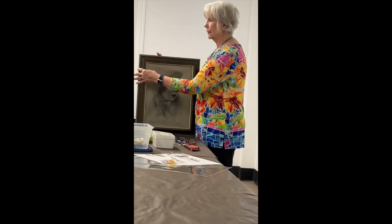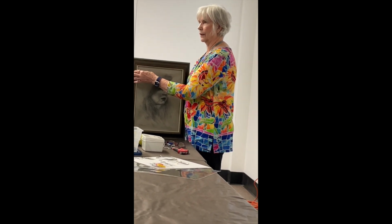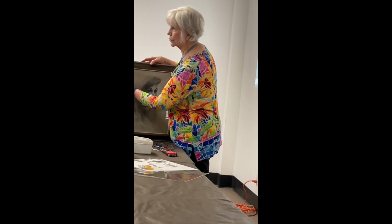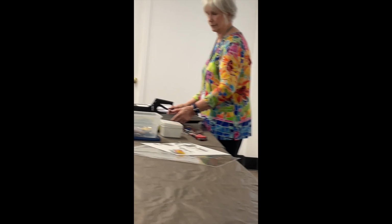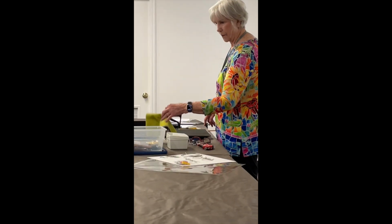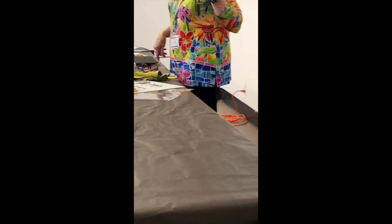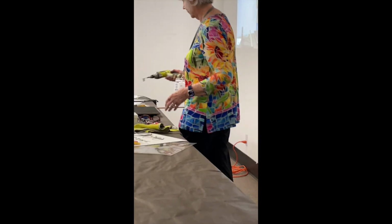So on this one, this part of the frame is fairly thin, but it does get thicker right here, so you're okay in here, about a ½ inch or more in. So be careful. We've even done it in the plein air frames. But that's the most important thing you gotta be careful of. Drilling a hole, putting that screw in, that you don't mess up the front of the frame. It has been done and it's not fun.